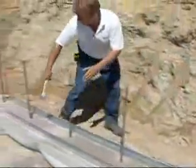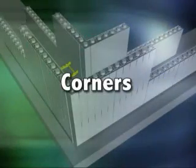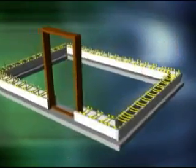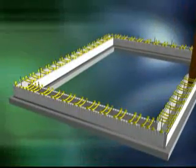Check the attachment of metal track to the footing before walls are built. All corners should be installed first. While other forming methods may call for building into the corners, the design and precise layout of the Quadlock system is best suited for building from the corners to a common seam in the middle of the wall.